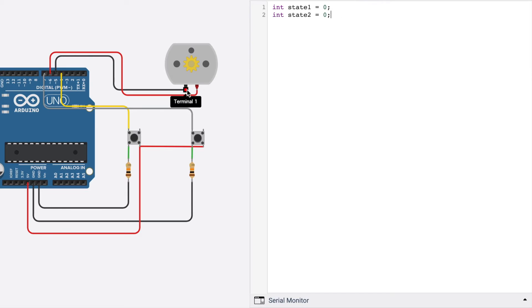We'll define our DC motor pins. Since we connected the DC motor's terminal 1 and terminal 2 to pins 5 and 6, we define: DC1 = 5 and DC2 = 6. Then we define the push buttons — push1 is equal to 4, and push2 corresponds to pin 7.